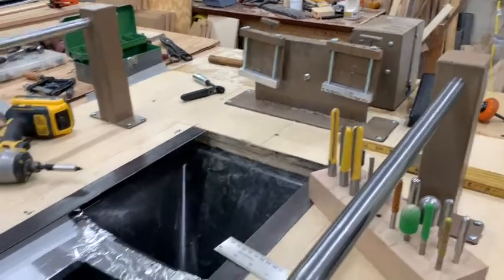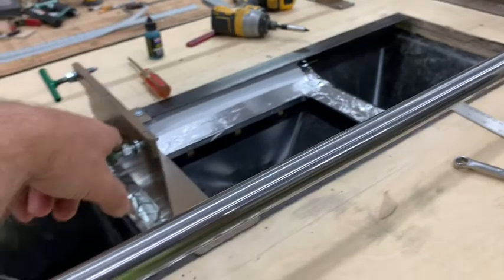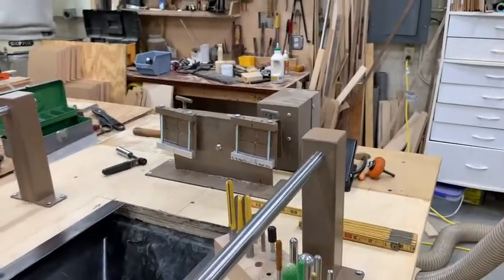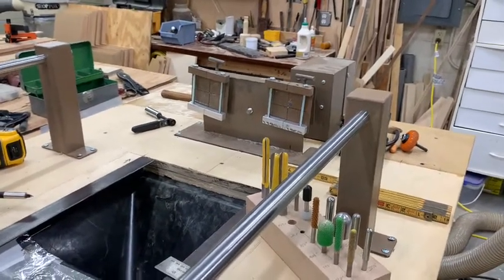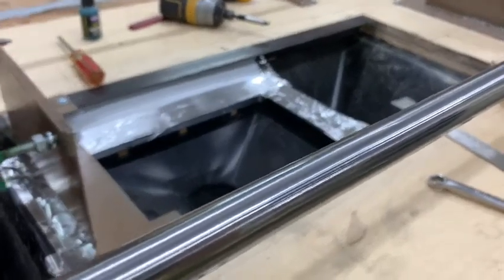I am going to upgrade this some more. I'm probably going to swap this out for actual tail stocks — they make tail stocks for CNCs that are scaled down, not like for a big lathe. They also make smaller four-jaw chucks for CNCs and I'll probably mount those on those. This is actually pretty accurate, but this quarter-20 coarse thread — it works, that's what we could say. I'd like to see a finer thread here because this is a pretty critical spot.